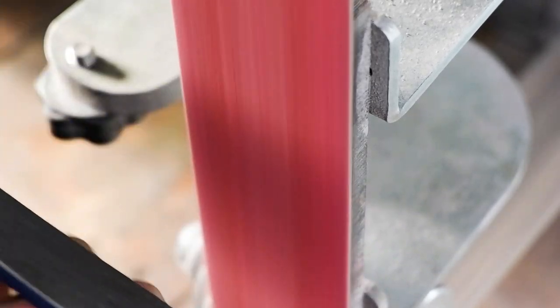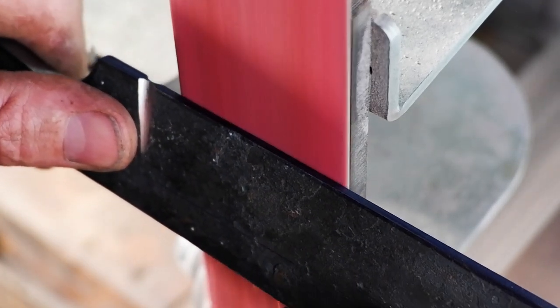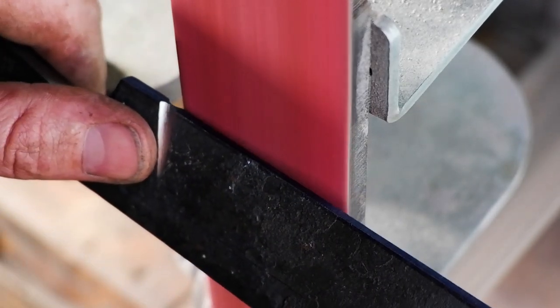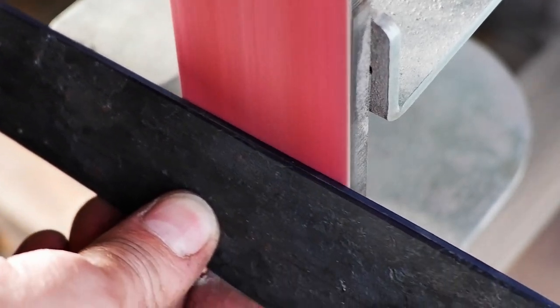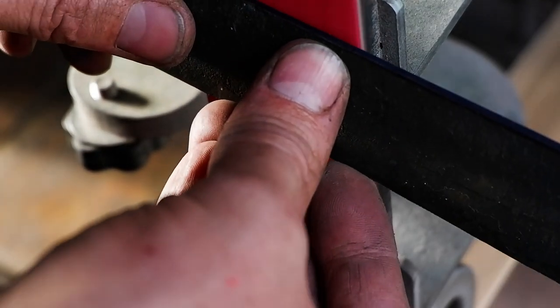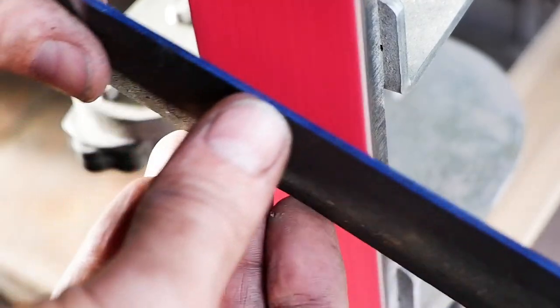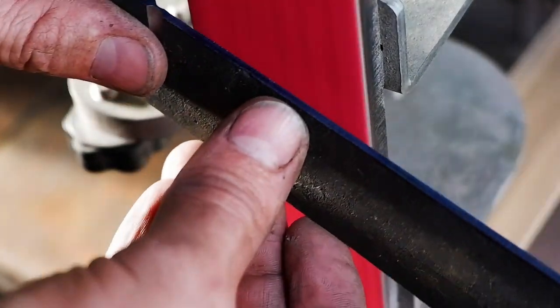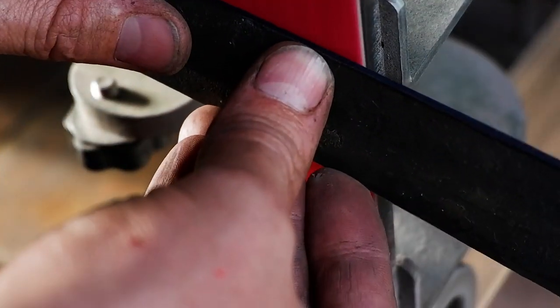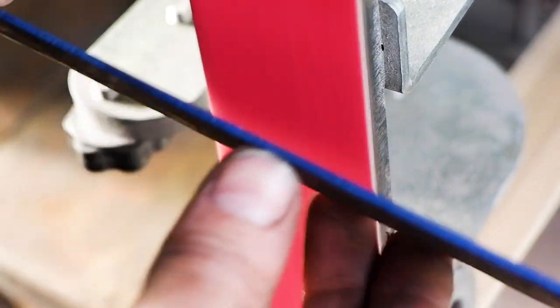Proceed to grind the bevels. I use a 36 grit belt on my belt grinder to grind off as much metal as I can. Then move over to my filing jig with hand files. I prefer to finish my bevels on the file jig because I can work much more accurately than on the belt grinder. If you are proficient enough with a grinder, then nothing stops you from doing everything on the belt grinder. But remember, grinders are aggressive, and one mistake can ruin many hours of work.